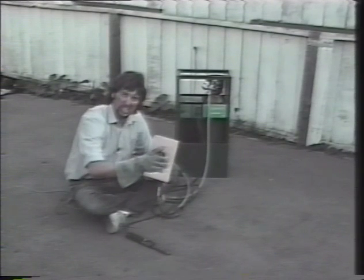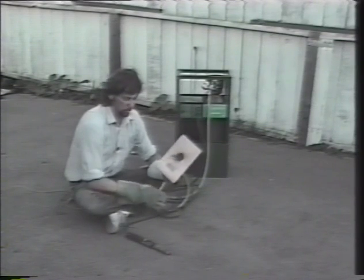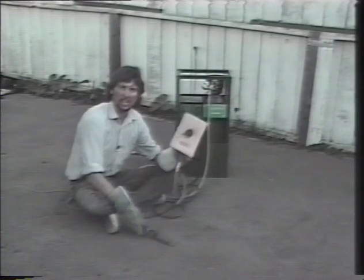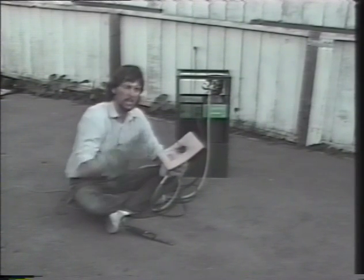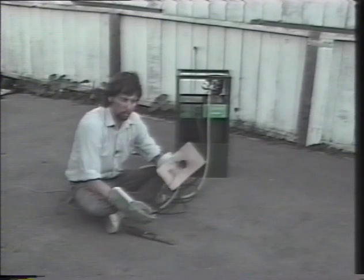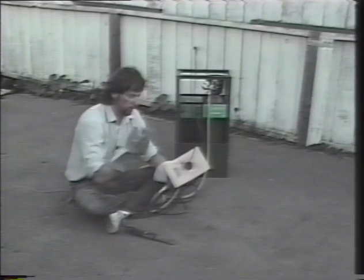This is steel, hollow inside, covered with copper, but it's steel. What this does, when we rub it and turn the oxygen on, which I'm not doing right now, we get ignition, very easy to light, lights the torch, the oxygen flowing makes the steel burn 10,000 degrees at the tip of this. This will vaporize anything in the universe. It's that simple. It's difficult to plug this into something and cut into it, but to poke holes or to gouge in everything from bricks to hard plate, solid steel, this device will cut it.